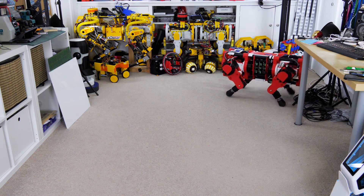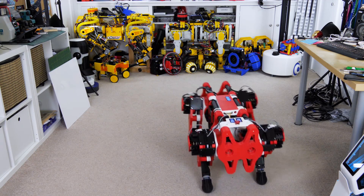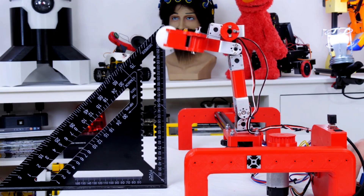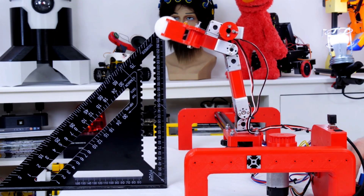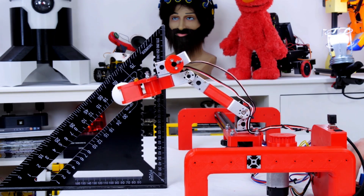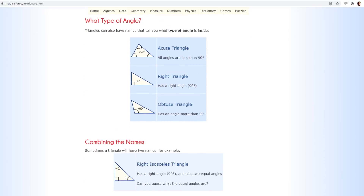I left the project with the mechanics built, the electronics fitted and the dog standing. The first thing I did to get this moving was sorting out the inverse kinematics. I've covered this quite a few times in other projects including Open Dog version 2. The simplest explanation is in my inverse kinematic driven robot arm project, but I'm going to quickly cover what I did to work through the maths. There are more advanced ways to calculate inverse kinematics but I like to do things the easiest way possible to understand and explain. For that reason I use high school trigonometry and divide everything up into triangle stages.